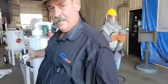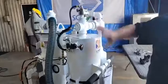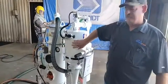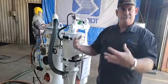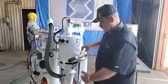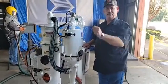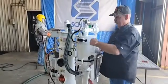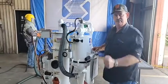Some other items I want to point out: this unit does have a reverse pulse system on that single cartridge filter. So as your operator sees he's getting some load-up on that filter, he can simply pop that valve, which initiates this reverse pulse to thump that filter and get the finer particles to come back down into the waste bins for disposal. Also notice on the bottom, the air comes into a cyclonic separator where we cyclonically separate most of the dust out of the air before that air even gets to the filter. So this pre-cyclone protects that filter much more than other units that don't use cyclonic separation.